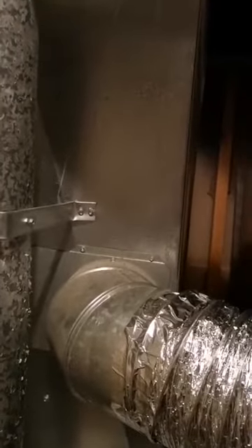I connected the supply line from the furnace to the humidifier. The pad is installed and I connected the water — when I turned it on, the water started flowing and then stopped at a valve. There must be an actuating valve underneath, so it won't open unless power is supplied. There's also a pressure differential switch here. Since I installed the humidifier on the return line, I need to connect the grey nipple to tap into somewhere along my furnace — that's the next step.